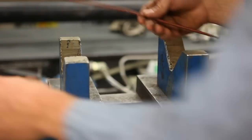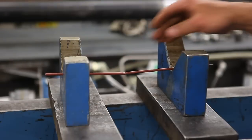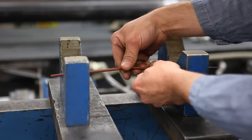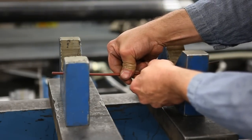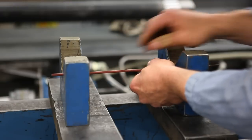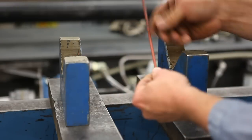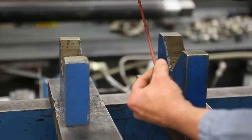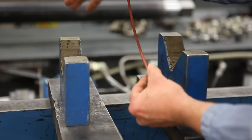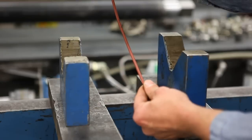And in straightening them, we found that, say this is the rod that's bent, when we counter bend only enough to make the rod straight when it leaves the press, it still leaves a lot of internal stresses inside where the bend was. And so when this gets under a load again, it's going to want to bend back to where it was when it was bent.